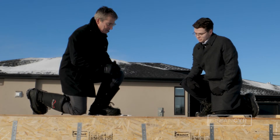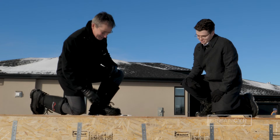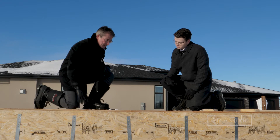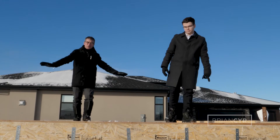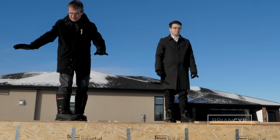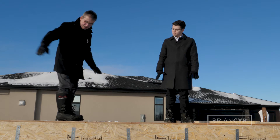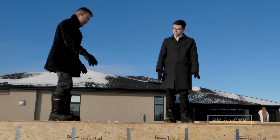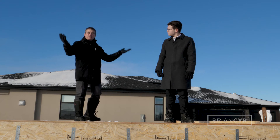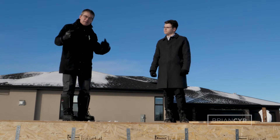So what's the first thing you notice when you're looking outside here? What's going on? Oh, I see that this foundation has been capped. Exactly — so we've got rim joists here. Now here we're actually standing on the subfloor. The subfloor is the basis of the whole home. So what the builder does is that the foundation is all backfilled all the way around the concrete. Then the whole main floor is capped with a system of rim joists, and then plywood on the top to seal everything up. Then we build up from here. We'll talk about exterior wall framing, interior wall framing, roof systems, and materials.